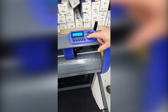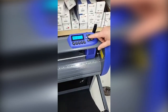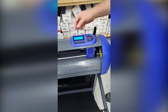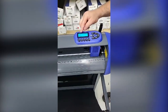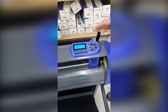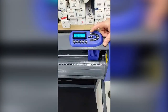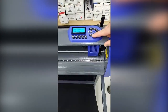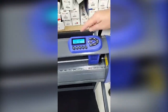The left and right arrows, when in the off mode, move the carriage left and right. If you press it real quick, it only moves it a little bit; if you hold it down, it runs. We want to push this button again to get back online — that means I'm connected to the laptop. I can also use these arrows to control speed and downforce. We always want to start this machine off with a speed of 300 millimeters per second. As we get more comfortable, we can graduate to 500 to 800 millimeters per second. I want to start my force at 90 grams — I'm at 93 now, so I'll get it to 90. That's where I want to start — always start at this speed and this force.